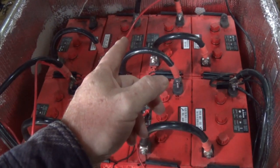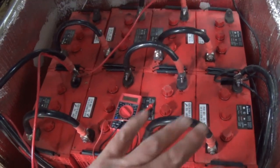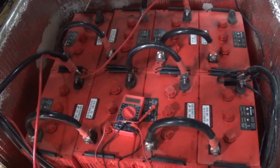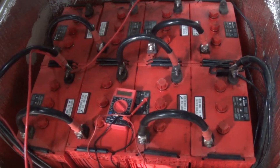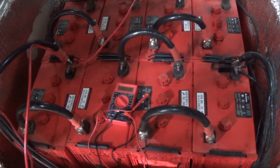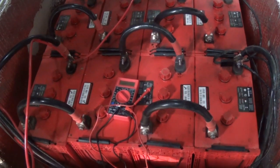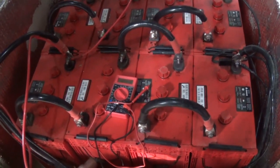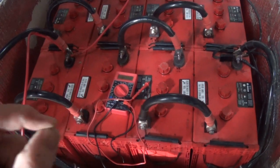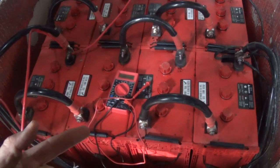What I think happened is these good batteries were working overtime to keep the bad one going, which has been depleting them and reducing their capacity. These batteries are 10 years old, but if that one bad battery hadn't gone bad and depleted the others, they should have lasted 20 years. Deep cycle renewable energy batteries, if kept above 85 percent charge and water levels maintained, can last 20 years — because the life cycle is measured at 80 percent, and depleting below that kills a cycle.